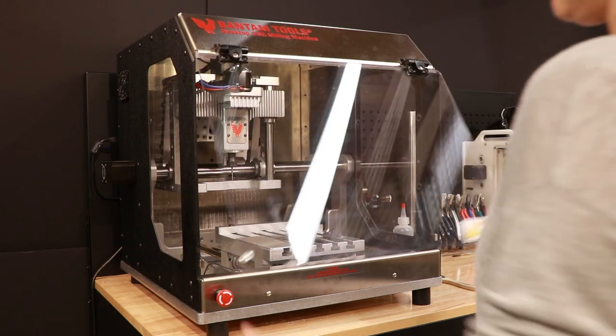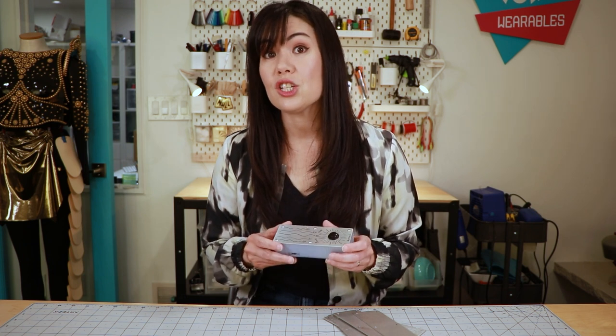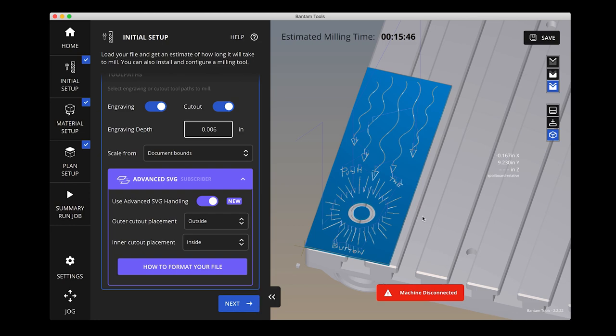The desktop CNC mill is purpose-built for milling small parts out of aluminum, and in this video I'll show you how I used it to engrave a hand-drawn design into an aluminum box lid. I'm pretty new to programming CAM for the mill, so for this project I used a much easier workflow: 2.5D milling. 2.5D milling allows me to send a 2D SVG file to the machine without having to generate G-code in a 3D program like Fusion 360. The SVG workflow has been really great for helping me get started with milling because it leverages my background in graphic design and allows me to be really free with how I create designs, since there are lots of different ways to create 2D vector graphics. Here's how I did it for this project.